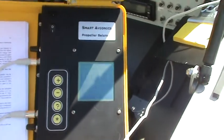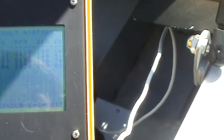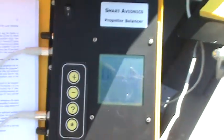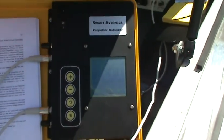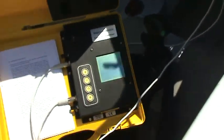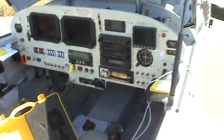There is the IPS history. I don't know if you can read this — it's 0.06 at 2100 RPM, 100 degrees out of phase. At 2300 it was 0.11, at 2100 it was 0.07, and at 2300 again 0.06. I usually fly it at 2300 RPM to 2100 RPM, and it's well under 0.15, which is considered a good balanced propeller. So you could sit around and play with it, but I think I'm going to call it good for a while. Anyway, that's pretty much it.